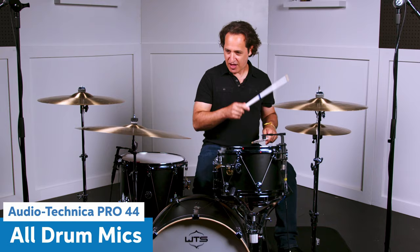From the back of the room, you're hearing the Shure Beta 91A, this boundary condenser microphone for low frequency sources. Its two position contour switch filters your low frequency response for added clarity and attack. It has an integrated preamp and XLR connector to reduce stage clutter and ensure quick and secure setup. Its frequency response is 20 hertz to 20 kilohertz.